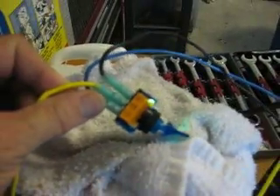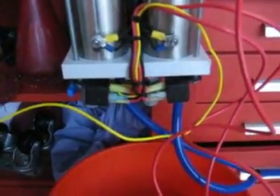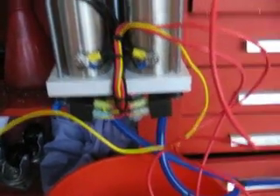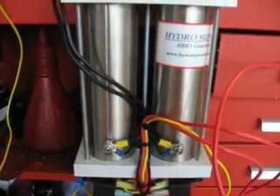I've got the negatives connected here with a bolt, and I'm just using this yellow wire to the ground. If you notice the two wires coming off the ground — this one's black, that is the ground. These go to the switch. The switch, blue, goes right there to the positive. There's the switch I talked about earlier. The yellow wire — I've heard that sometimes they're yellow on this unit, sometimes they're blue — that goes to the unit. That's what you have on your dash, that's what powers it. There's the wiring.